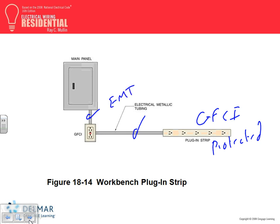If you have unfinished basements, you can't just put the Romex right against the concrete of the basement, especially if your basement is concrete. You have to have an EMT for protection. You have to EMT it. Are you guys following with me? If it's sheet rock, then no problem. But if it's a basement with concrete or blocks, then you have to EMT it. And that's what they're doing in this basement. If you read through the chapter, they're EMTing the shop. Any question, guys? Multi-outlet assembly?